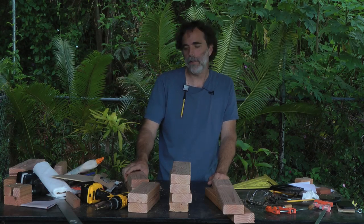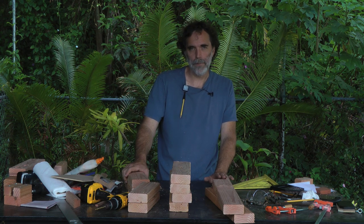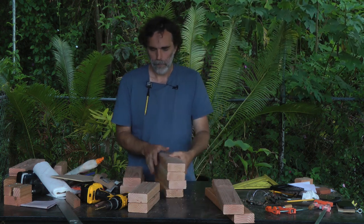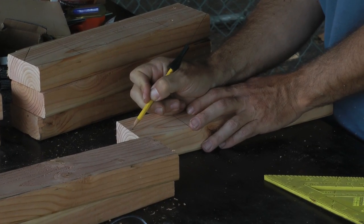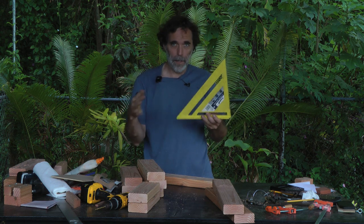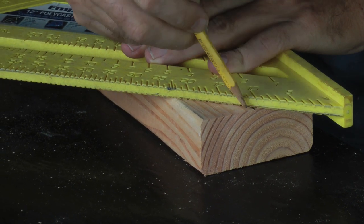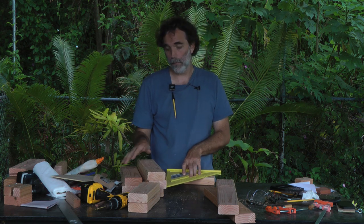Now that all the wood is cut and drilled, we're ready to put it together. There's one optional step before we start screwing — it's just a way of making your pallet table a little prettier. For all the 14-inch and all the 12-inch pieces, put a mark halfway across the two by four. This isn't critical, so you can do it by eye. Then take a 45-degree measurement — you can fold a corner of a piece of paper to create a 45-degree angle — and draw a line and cut that corner off.